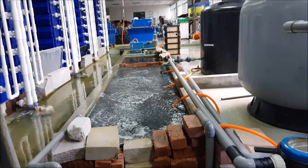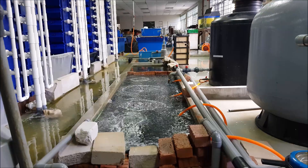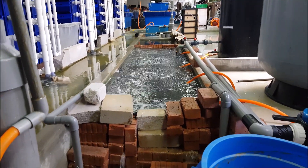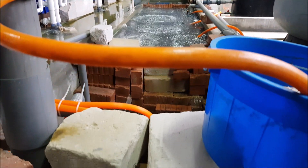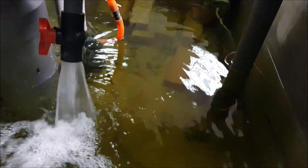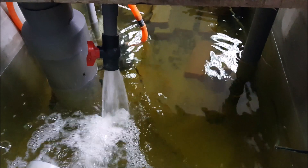...the water that is entering the crab house. So we have here the biofiltration, and after the biofiltration our water is actually being flown into a sort of a small reservoir in which we have a skimmer — a DIY skimmer — that is used to skim out any additional fine solids that might have gone through the solid filtration and the settling tank.